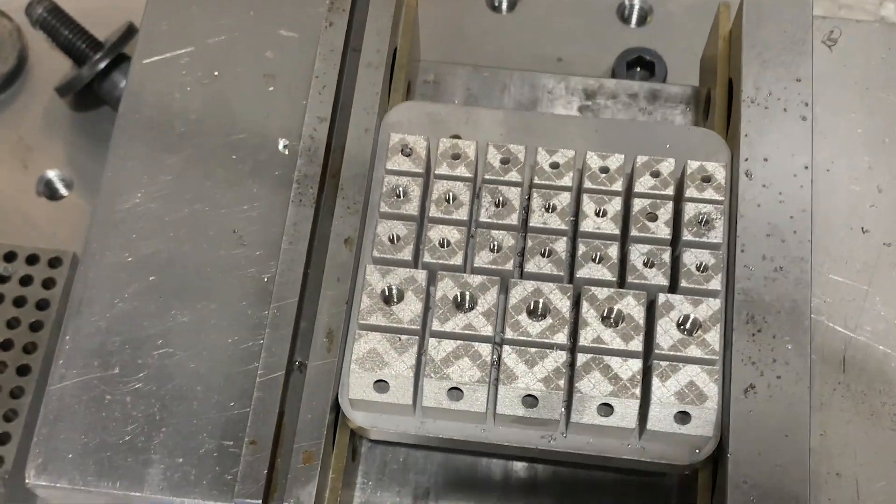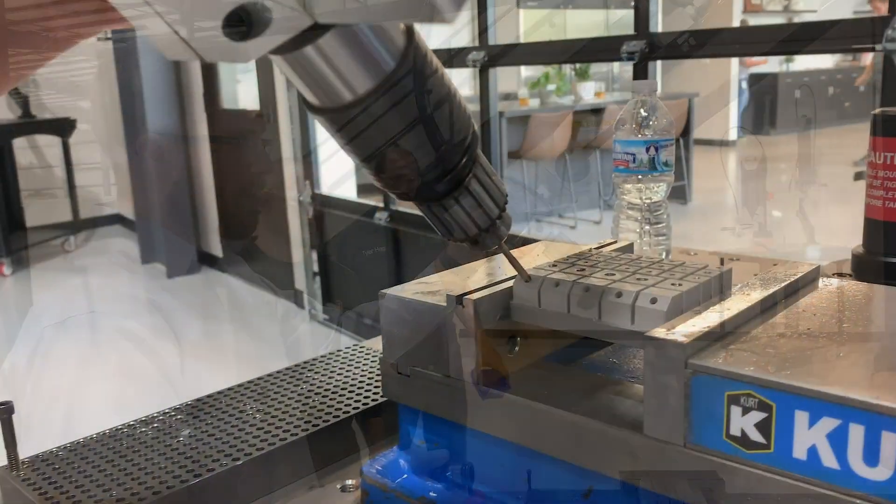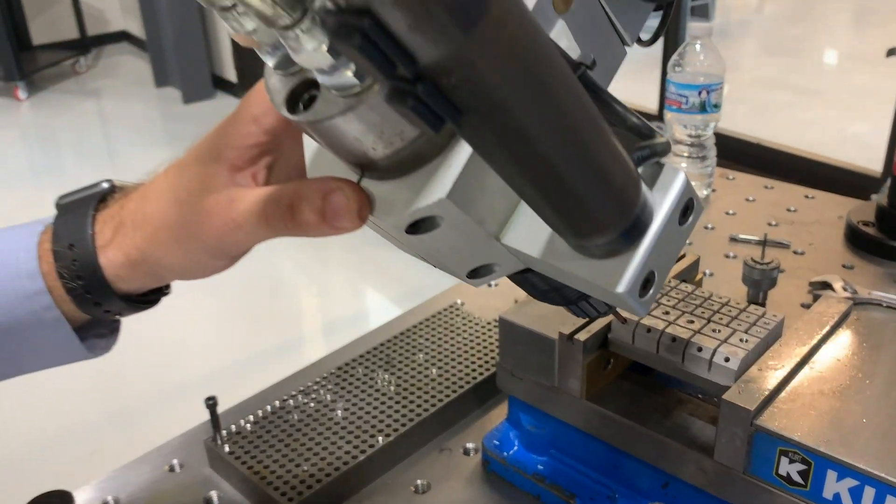And since the taps that they were using were so small, M3 up to M6, we recommended the A32 or GH18, depending on whether they wanted to go pneumatic or hydraulic.